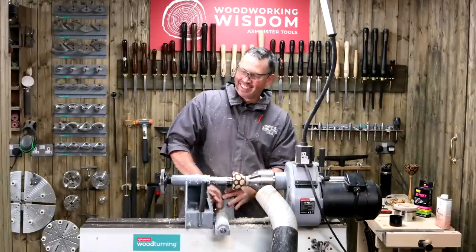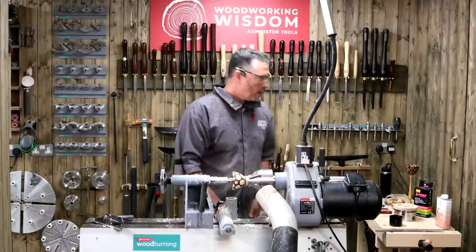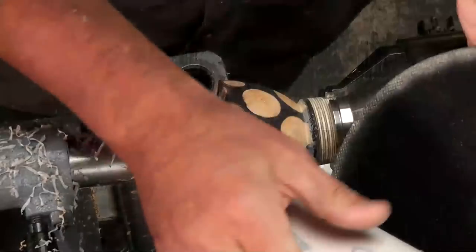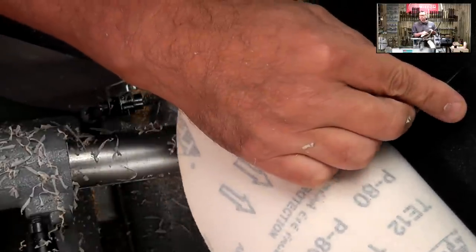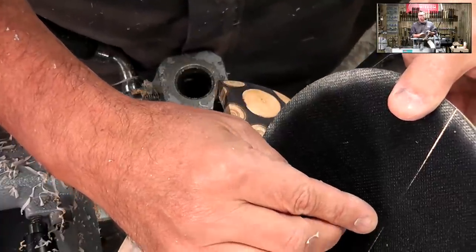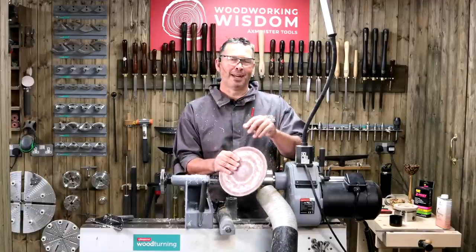And from Jenny, she's making her non-slip and sanding discs. What glues would you recommend to attach to sandpaper and the non-slip fabric? So on our sanding discs here, what I use is a Velcro type material, so a hook and loop, and I use the same on the discs. This is a self-adhesive roll of the hook material. I buy this from Axminster Tools, sold in 100 mil wide by a meter long, self-adhesive. Don't search by putting in hook and loop, search with heavy duty, and it'll be one of the main hits that come up.